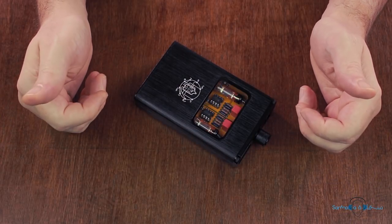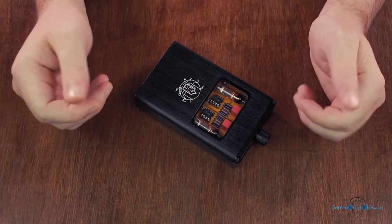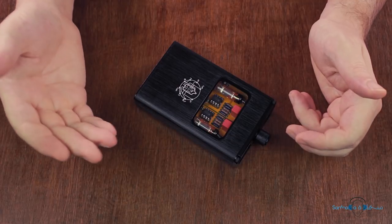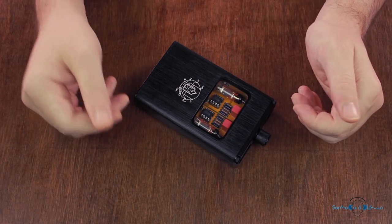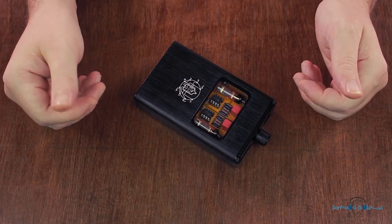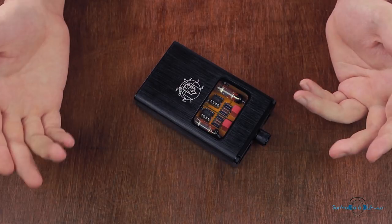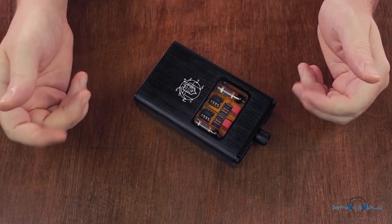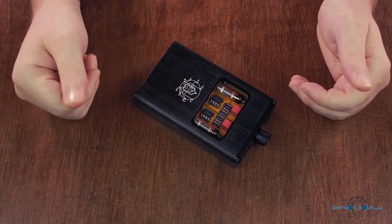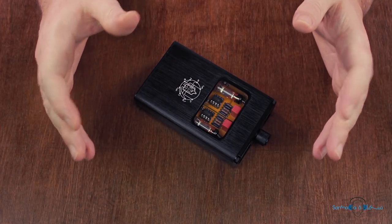When I reviewed the iFi Micro iTube 2 I briefly covered how iFi describes the different sound signatures of the various tube settings. Basically the difference in sound comes down to things like the circuit topology and the type of tubes used. For the purpose of this review, there are two things we want to take into account: even and odd order harmonics. Let's say we've got a signal of 1kHz. The even order harmonics would be the even multiples — so 2kHz, 4kHz and 8kHz — which are perfect octaves of that fundamental tone and tend to add a sense of warmth and fullness to the sound, although that 8kHz point can be problematic for other reasons.